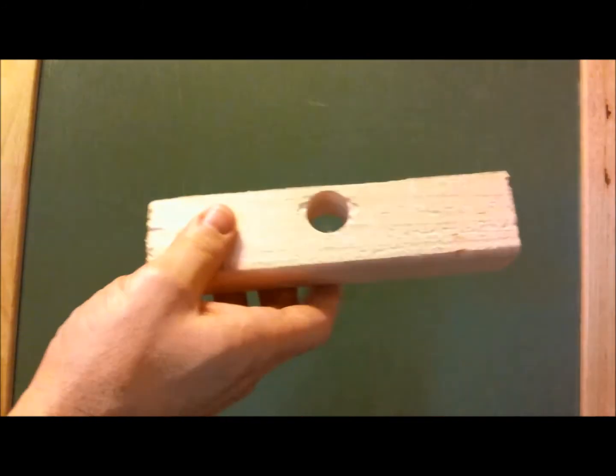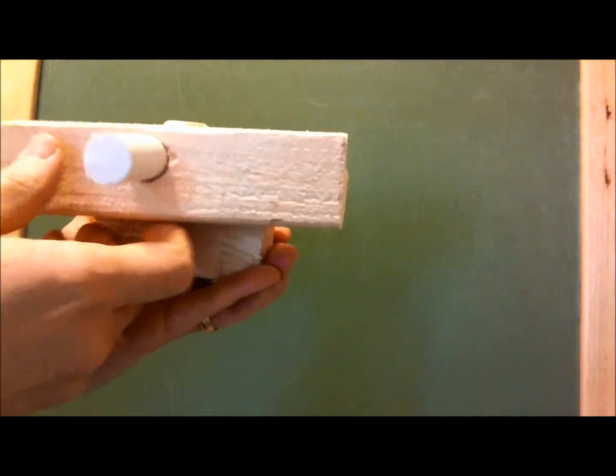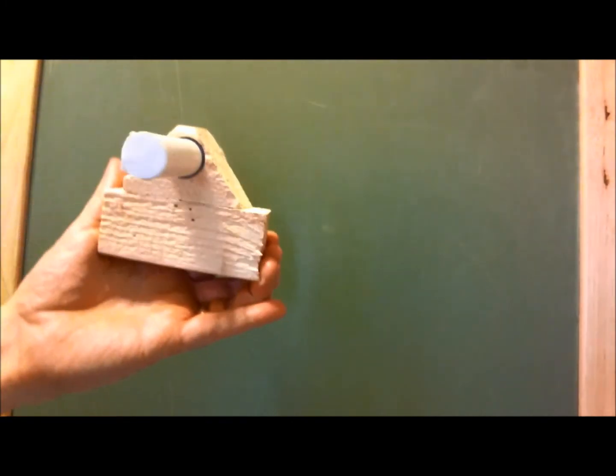And the second part of the assembly we'll call a seesaw element, which is a block that has a hole in it. So that's the mating element to this pin. And we'll assume it's frictionless, and so we'll assume that if there's any torque that wants it to rotate, this part will continue to rotate about the center point of that pin infinitely at the same rotational velocity.